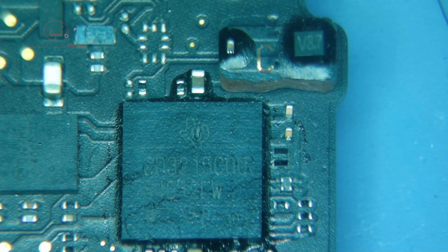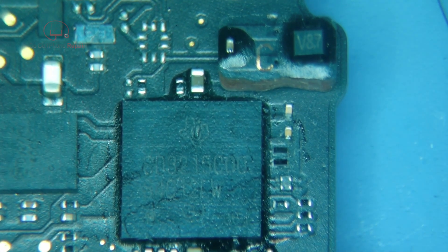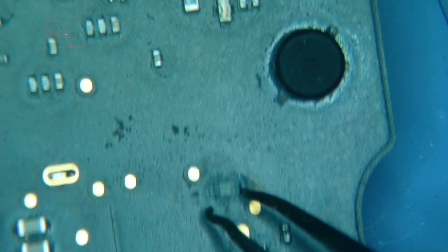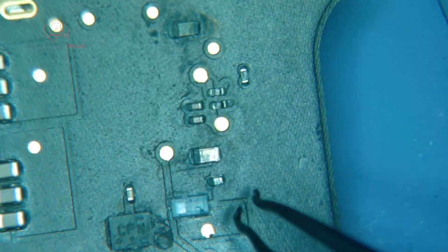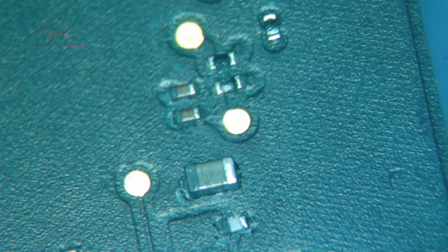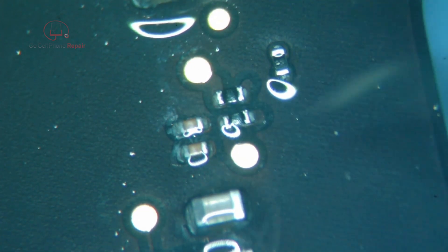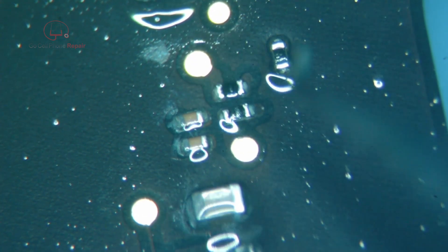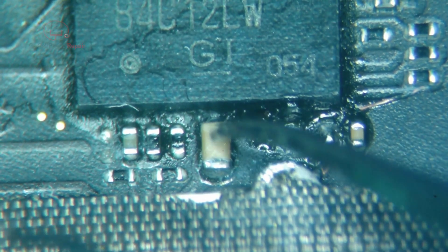The one that was here was bad for sure; this one looks like it will be bad soon enough, so I'll go ahead and replace that too. This one right here will also need to go. Some of the others may just be discoloration rather than actual corrosion, so they may not necessarily be bad. I'll reflow those with some solder later — if they shine up a little better we'll probably leave them. But this one is actually physically damaged; we're missing part of the contact, so we'll take that off and replace those two, and then hopefully we will have a functional charging system.